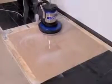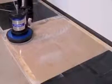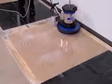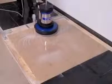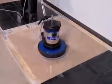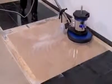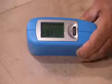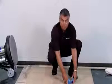You should have a wet vac to pick up the slurry, or you can use a double bucket system where you have clean water in one bucket and pick your soiled water up with the other bucket. Okay, what we're going to do now is pick up this slurry and then put the gloss meter on it. Let's see if the 800 did indeed smooth the surface out a little bit. We have since rinsed the floor. Now we're going to check our gloss meter to see if we have smoothed the floor out even more. 3.7. We're making improvements. Now we're going to go with the 1500 grit.